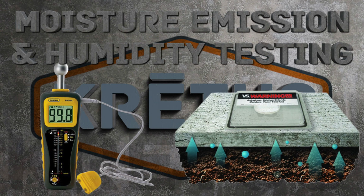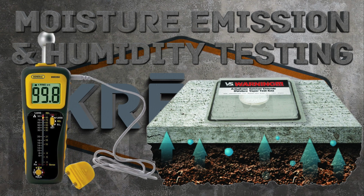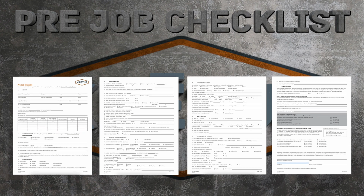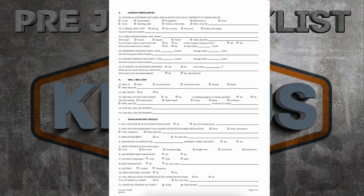Before you select any Kretus system or product, conduct moisture emission and humidity tests on the concrete. Then, fill out your pre-job checklist. This will help you determine the right Kretus products to use in the system.